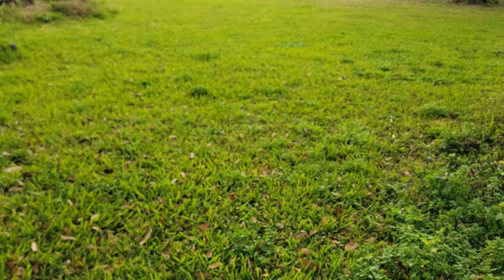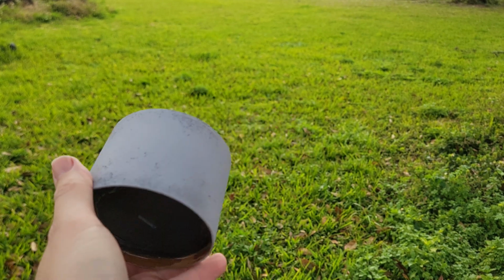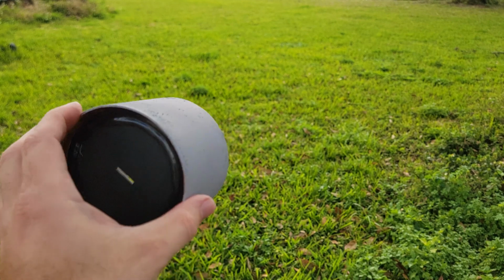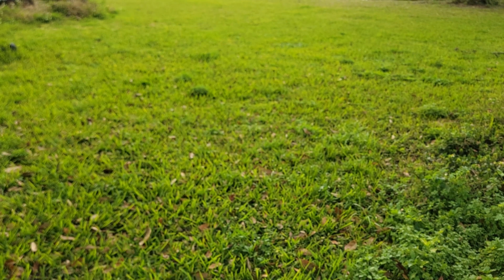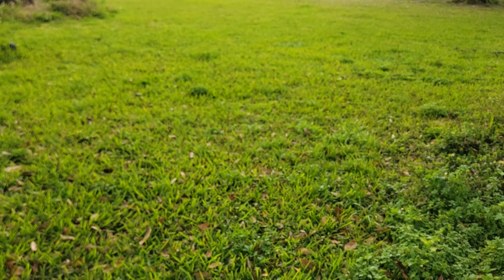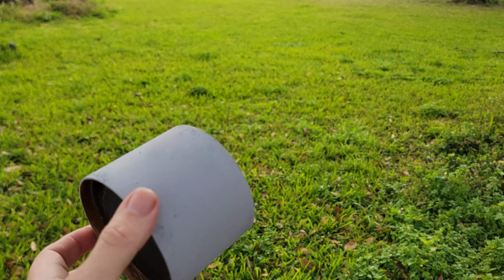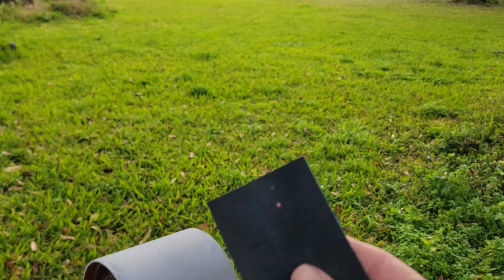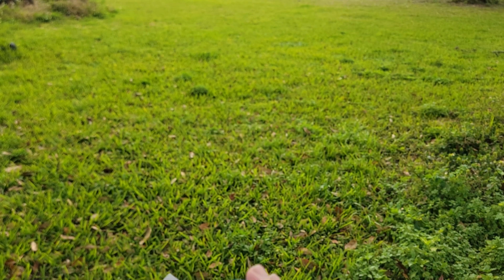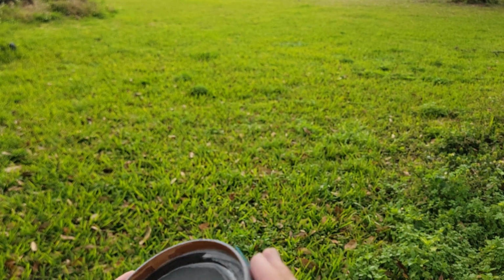And as far as the piston goes, I got that painted. It's been dry for a long time, that's for sure. Let's just say that. Now, we have to decide how we're going to do this, because this has to be sanded, because it's way too thick to put in that 4-inch body tube now. So I put a couple coats on here of the gray primer, and I'm thinking I could probably start with 220 wet, and of course, yeah, I could get in there a little bit. I ain't worried about that.